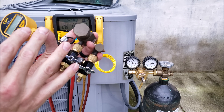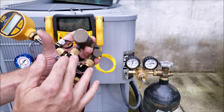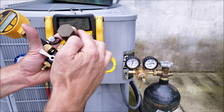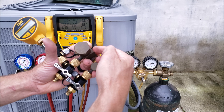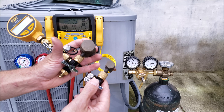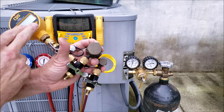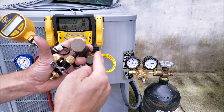You should not use the vacuum as your primary pressure test method, because if you do have a leak, you'll be sucking hot, humid air into your tubes. The purpose of a vacuum is to remove air and any moisture in the system — you pull and hold that vacuum, then break it with refrigerant from the bottle or from the system.